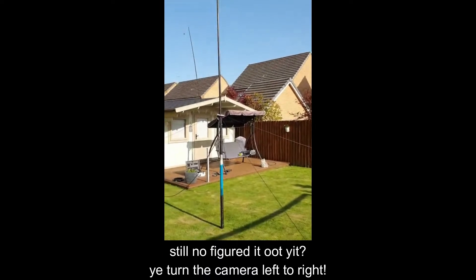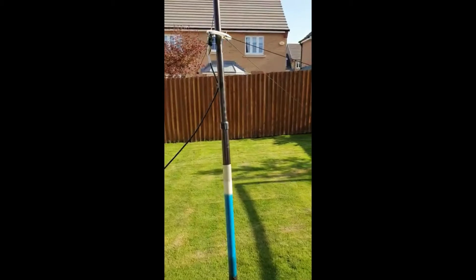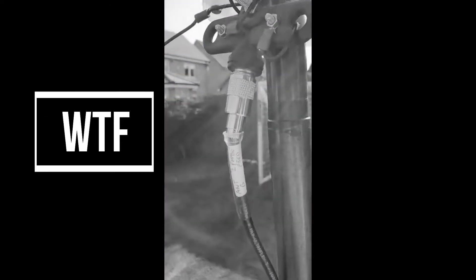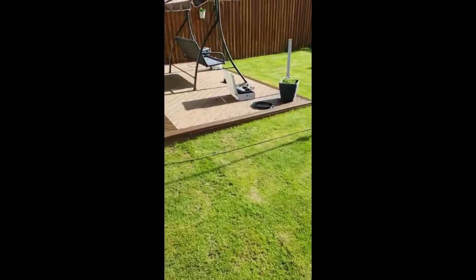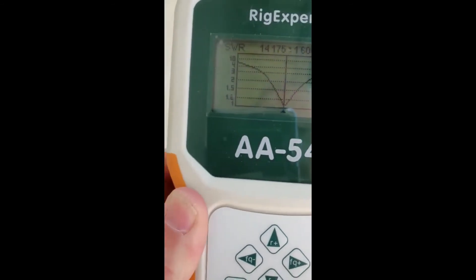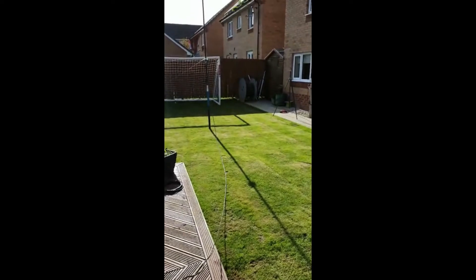This is the 20 meter phased array from Billy, GM6DX. This is antenna B with the raised radials feed point — construction on PVC board, tied on to a center SO-239 dipole center. Just going around to check the analyzer — the first one was tuned really good, the second one just as good.